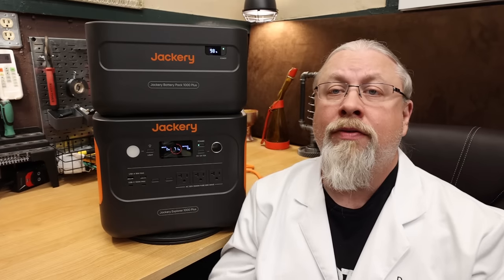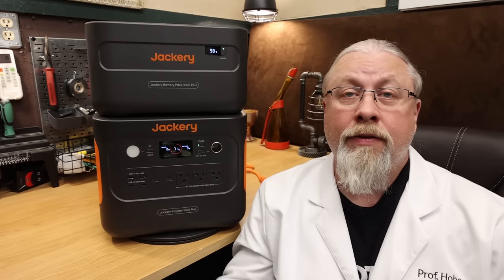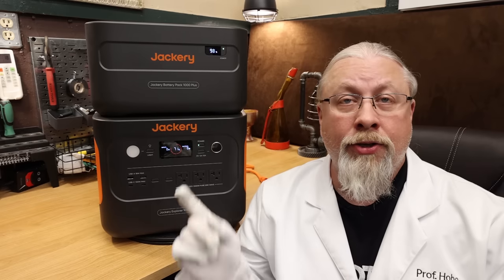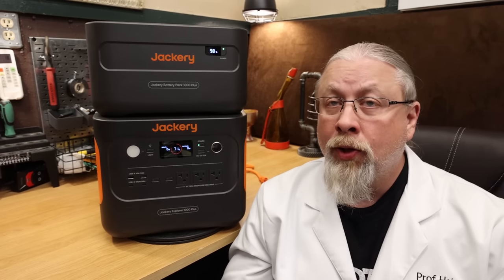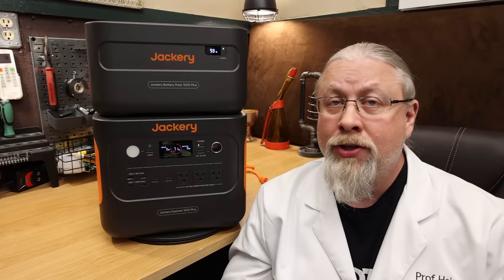This information is useful if you plan to run small loads off the inverter or plan to run a 12 volt fridge. The AC inverter test runs for 4 hours and then the DC test runs for 12 hours. I then recharge the unit via DC through the solar port for the most accurate result and measure the watt hours to fully recharge until it shuts off.